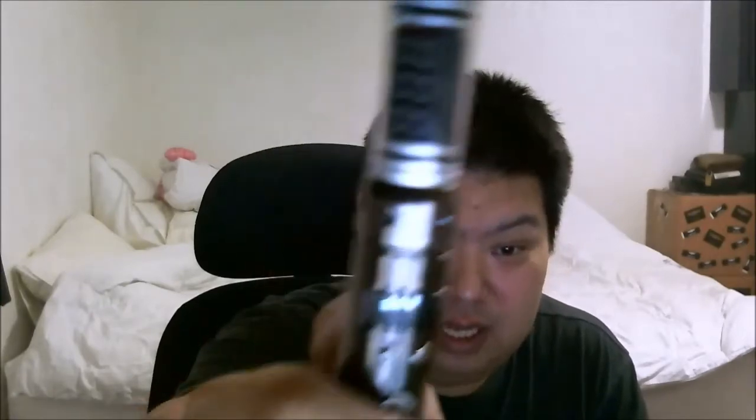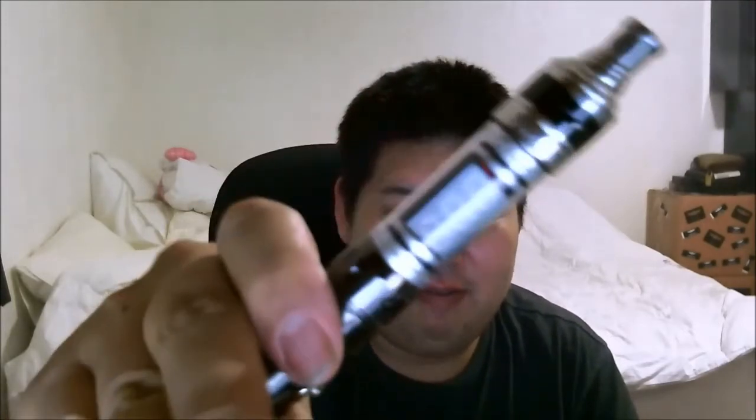So on a single 18650 battery, it lacks power. Now let's go ahead and stuff in two 18350 batteries — stacked. This thing is gonna be producing some massive voltage. We have the system on, and if we look at the voltage on the battery, we have 8 volts. Now when we vape this — remember it's giving me 4.3 volts on a single — this jumped up to 6 volts, giving me 5.44, 5.43. It's pulsing and giving me a stable 5.6.